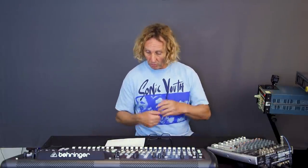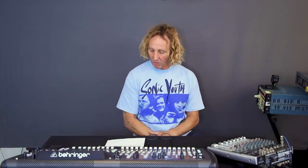We can try that down the channels too. We can try channel 1 nulling channel 32 to see if there are differentials regarding where you're plugged into the board. Cable length, like I talked about, I'm going to look at cable length. I'll get 100 meter cables of various types, see which ones work, which ones don't, and then some extensions, maybe 10, 20, 30, 40, and 50 meter extensions. Then I'll apply those same extensions to multiple cables and we'll find out where those various cables stop working and see which ones give us the most length, to help weed out the weak ones.